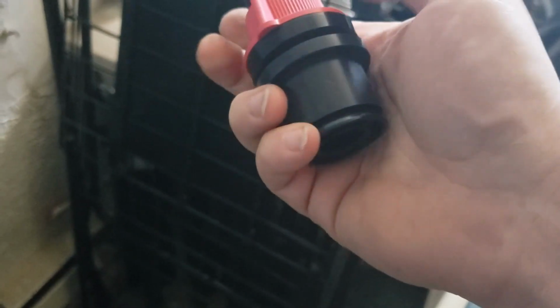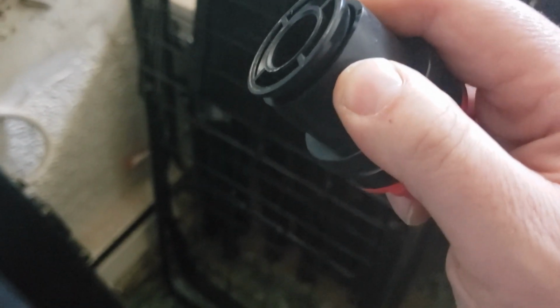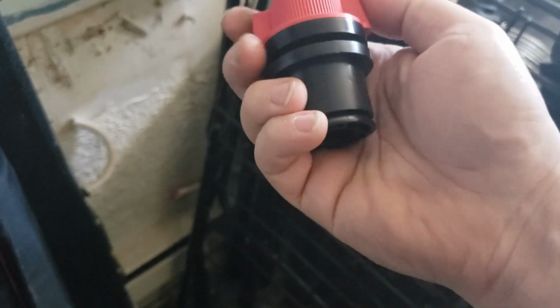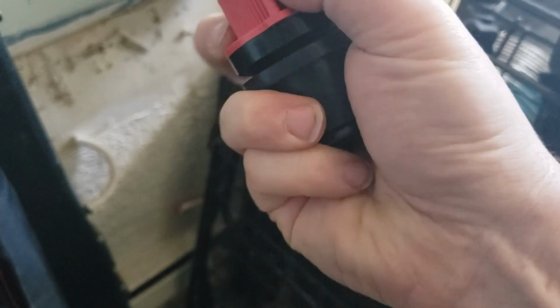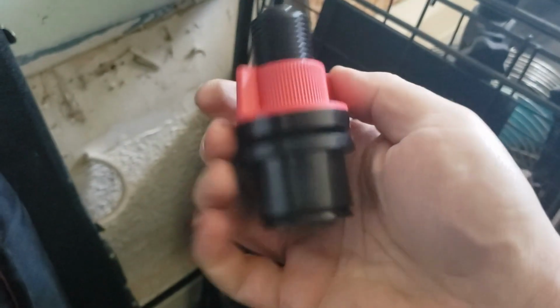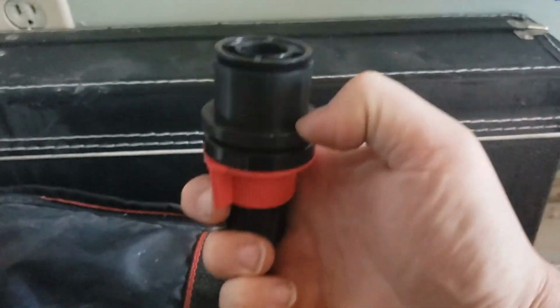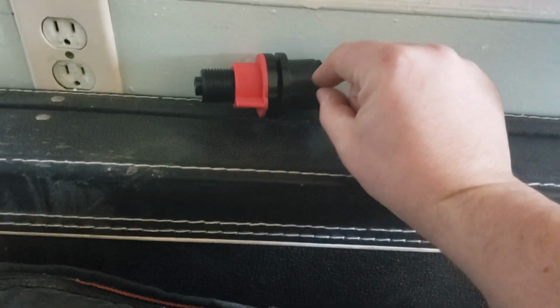And the way these work is you put them in, and as you tighten this down, there's, I use the word rubber, it is not rubber, but there's this whole piece right here that will compress as you squeeze. Tightening this pulls this up through here, which will put pressure on this piece, which will cause it to expand and get wider. So you put this in the pipe. This sits up at the edge of the pipe. You tighten this down. It squeezes this, which makes that rubber bulge out. It's called a test plug.